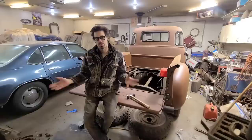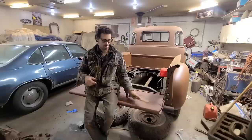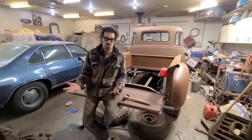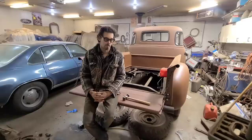I thought you just take this thing, stab it on, and sit there and let it do its thing. But he's like, no. He showed me, and he just very lightly arced it across where he's trying to shrink. And just like what I was doing with the Unispotter there, it just leaves those tiny little dots. I thought there's no way that's going to do anything. And sure enough, it actually did shrink that panel and tighten it up again, and we were able to repair it. So I thought, well, that's interesting the way that works.